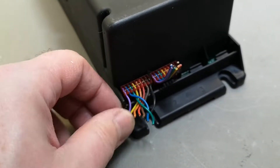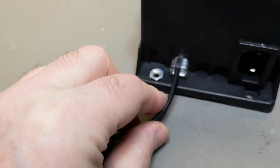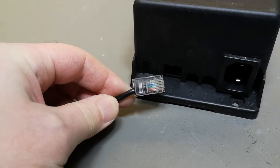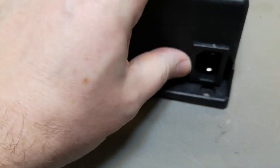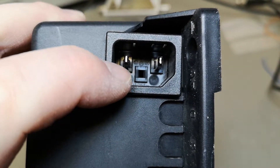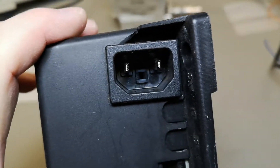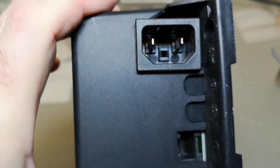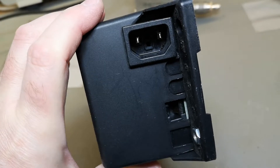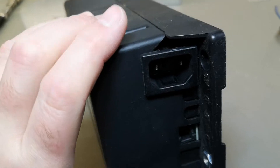The motor connectors are a lot different, and here are the table buttons. Again, they use the same power supply connector without earth. I must say it is a little bit against my religion not to have earth on stuff like this. I would really prefer if all metal parts on this table were connected together to earth, just for safety.